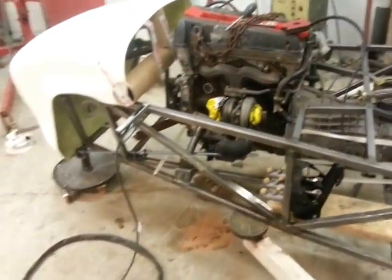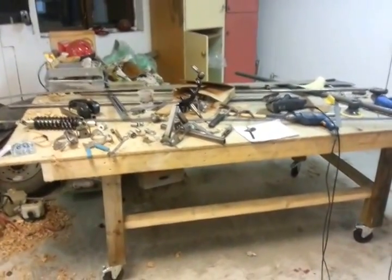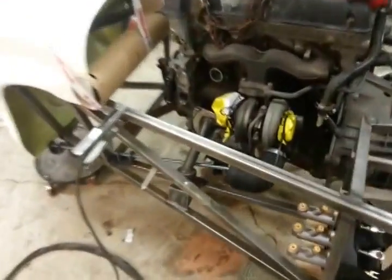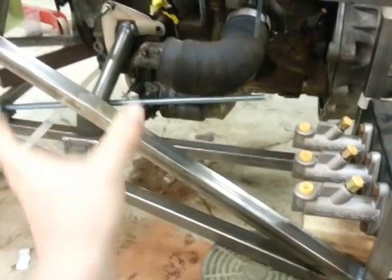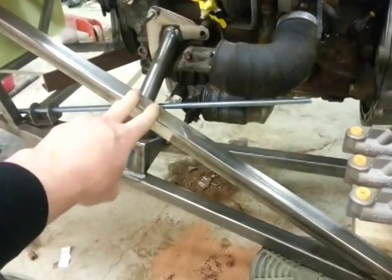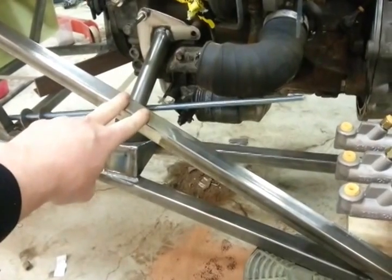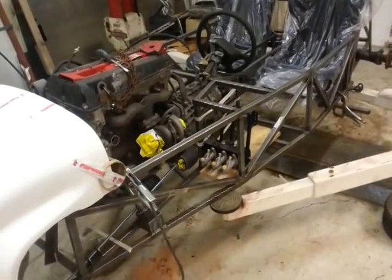When I had welded all the parts together, I put it out on the table again and made sure that it was straight. I had a misalignment of a couple of millimeters from end to end. When I welded that section together it actually warped itself a little bit, so I had to split it up again, straighten the frame a little bit, and weld it back together again. Now it's actually really, really good. That is the frame — the basics of it.